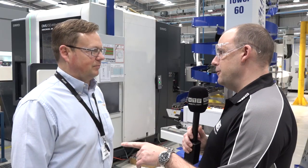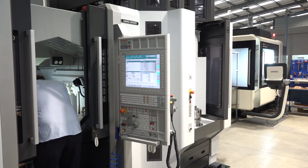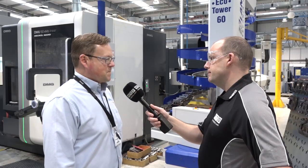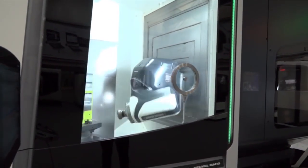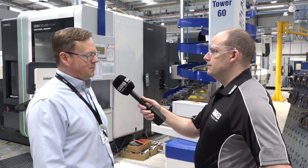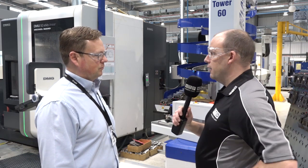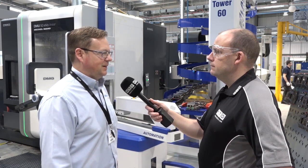Looking at the difference between the Evos and the P machines — the Evo is a little bit of a smaller machine. Would it be fair to say there's less capability with that machine than the P? For larger parts where we need to be, we have a lot of structural assemblies — we make thrust reversers and high lift mechanisms for the aircraft industry, and we're boring holes from both sides. We like the fixed head from the P machine and rotating the axis, whereas the Evo linear is more for prismatic high-speed aluminium machining. The P machine has a knuckle joint head, and it really comes down to the type of application whether we put it on the P machine or onto the Evolutions.